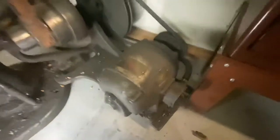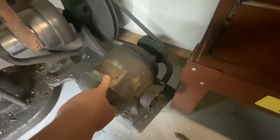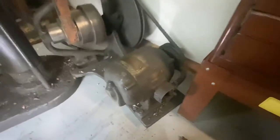What it has on it right now is a one-horse three-phase motor. It spins at 1,200 RPM — kind of an oddball RPM. As you can see, it's an ancient motor. So I'm going to put a 1750 motor on if I can find one, and just put on a smaller pulley. This probably has a four-inch pulley, if I had to guess.